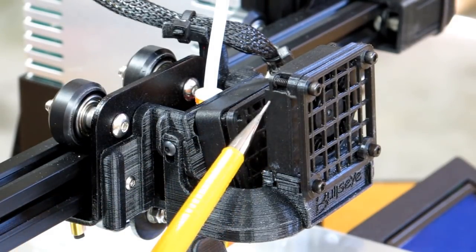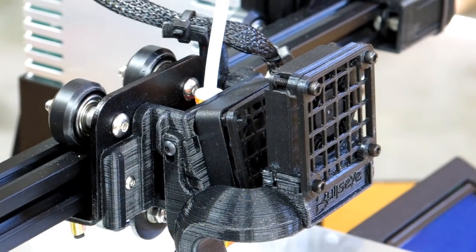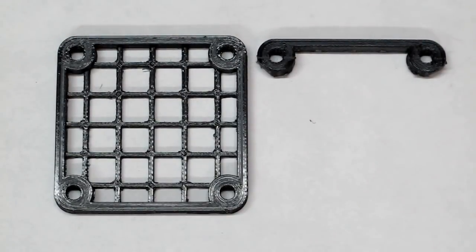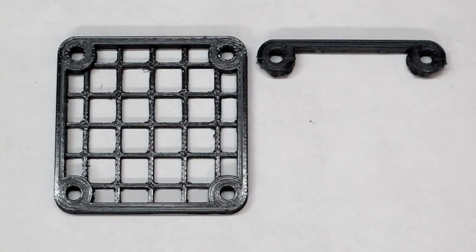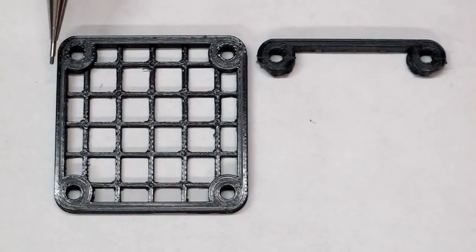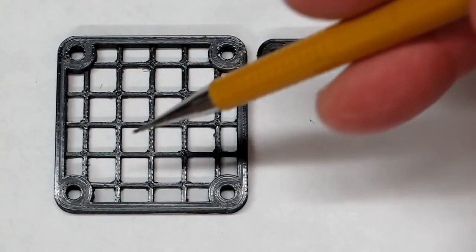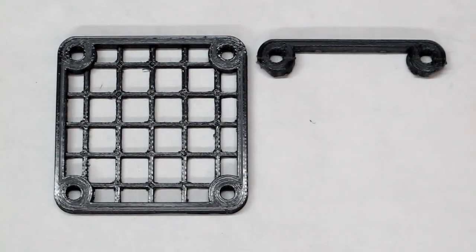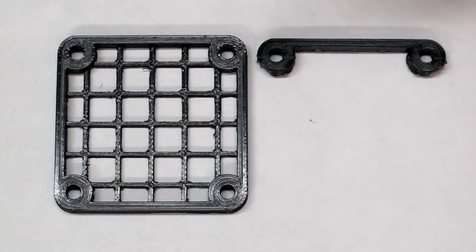This is your filament cooling fan — I use a slightly different size grate. The standard 40mm fan cover, or fan guard — there will be a link in the description to the Thingiverse listing for those — is 40mm from here to here. I stretch the X and Y dimension until that's about 43.5mm, or until I get 35mm center to center on the mounting holes.